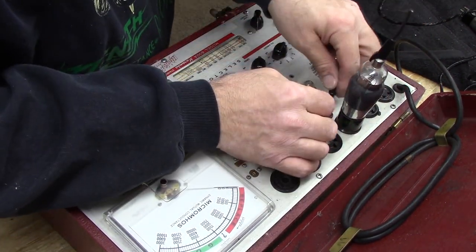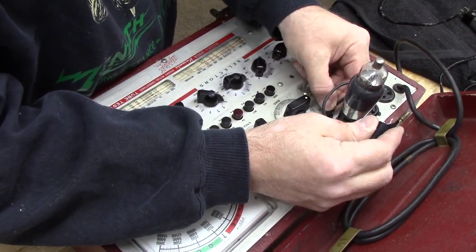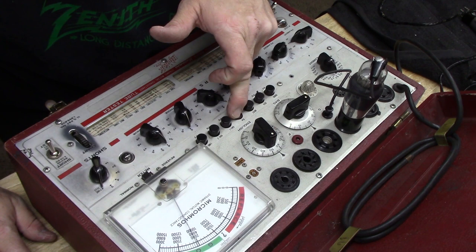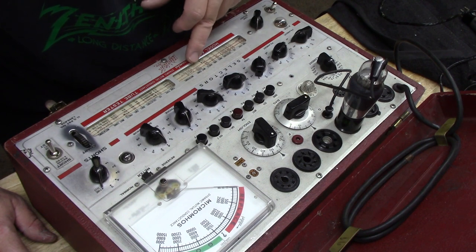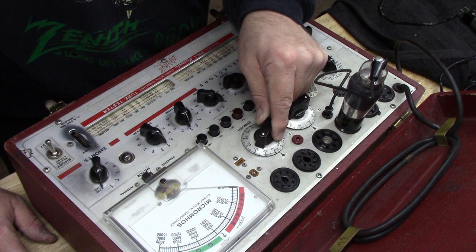I'll make a new cable. I'll use alligator clips. Okay, grid cap there, grid cap there. Now, let's push P4. Excellent. We are at, well, it says good. Now let's go. It's supposed to be 1225, so that means that is the red dot for the low, which is at just below 3000.